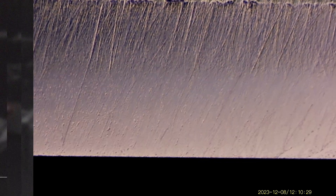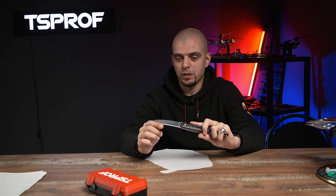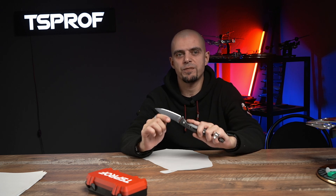Let's test the knife and see how it cuts. This is the cleanest cut I've seen in several months — this knife is one of my favorites. When we talk about steel S290, it holds the edge better than many others. You won't see such a clean cut on traditional steels. Despite the fact that the steel requires additional corrosion protection and is a bit fragile, when you can make your blade this sharp, it's worth the money it costs. If you still have any additional questions about sharpening of this steel or the steel itself, please leave your comments down below. I'm always happy to see you and I hope to see you next time.